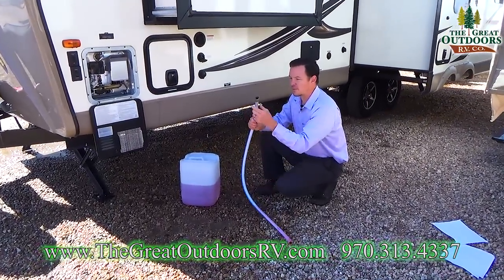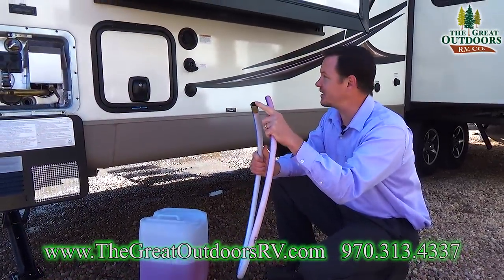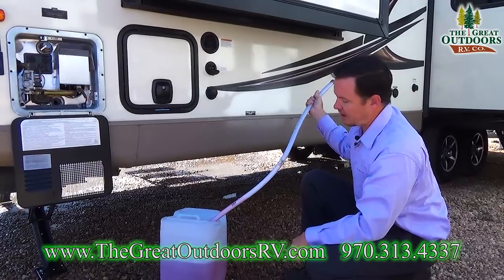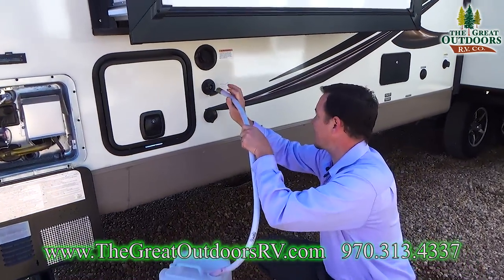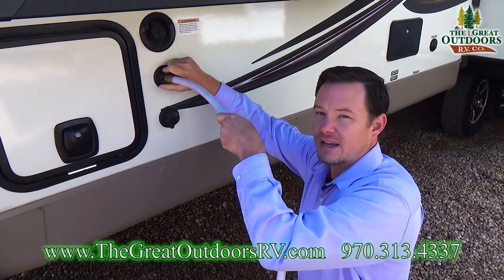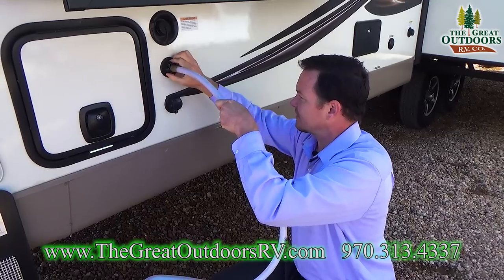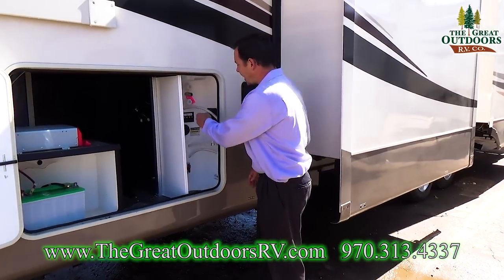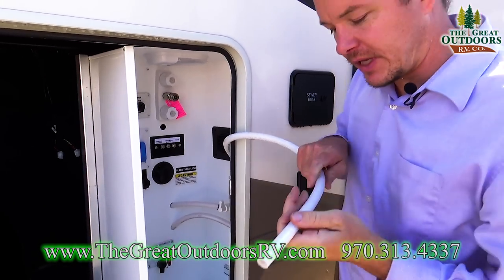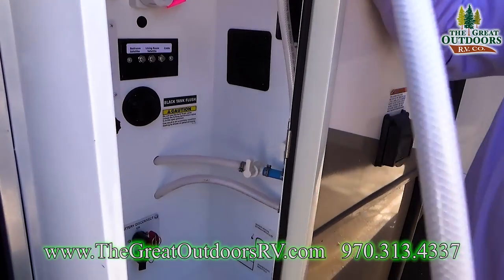This is a normal garden hose — you can take your old garden hose and cut off one end. You need the male end usually to make this work. Then stick this in the gallon of antifreeze — or two gallons, however many you have — and this goes right onto the antifreeze inlet. Don't get that confused with the black tank sewer flush or the city water connect. Some campers already have the hose for winterization in them — you connect it to your jug of antifreeze and there's a little valve that you turn right behind to turn the system on.